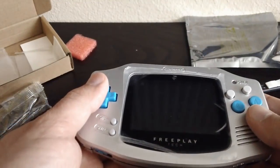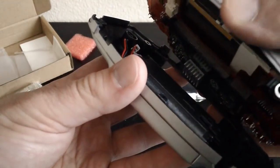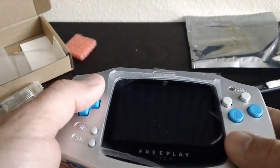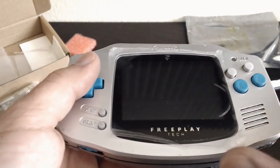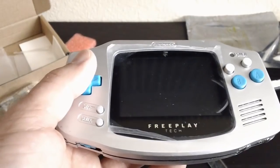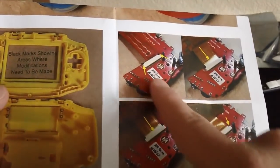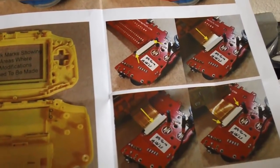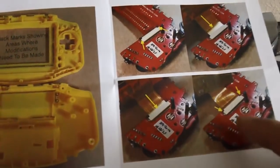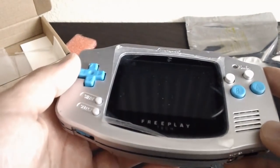This is actually the next day — I was not able to finish it last night. I do have it unassembled and the batteries are disconnected. I was able to turn it on though when I had the batteries connected. I was having an issue because the screen didn't seem to want to come on. But it turns out that was my fault — I did not install it correctly. It has a ribbon which you need to put into that little slot, and then it has those little pins which you need to lock down. So make sure you don't forget to do that. If your screen's not coming on, or if you're getting a pure white screen, that might be the problem — you just don't have the ribbon in there correctly.